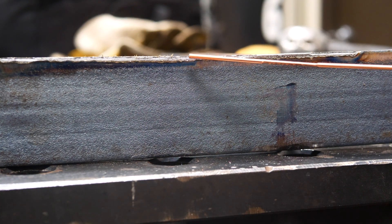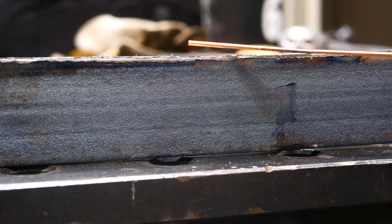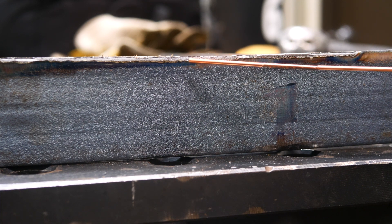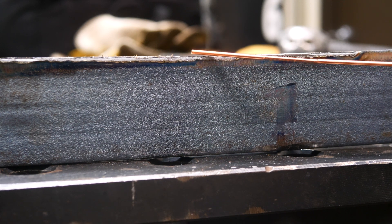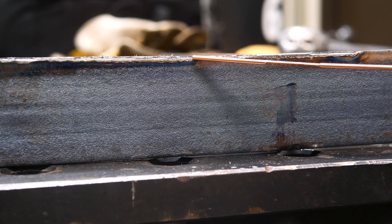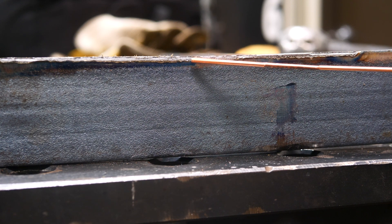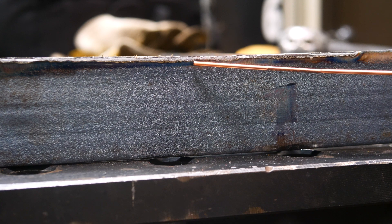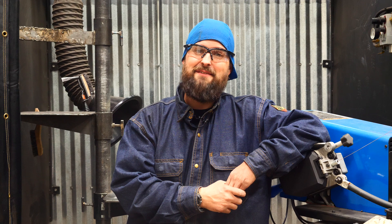If you want to do this properly and blend the outside with a grinding disc, you need to bevel the parent material before you start welding. Beveling means cutting into the parent material at an angle so you can mechanically achieve that depth of penetration. Then you fill it with weld, grind down the outside, and still maintain the proper throat. Thank you for watching — hope you learned something today. If you're interested in training with General Air, check out the link in the description below.